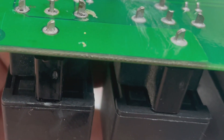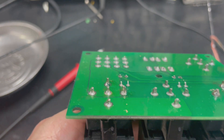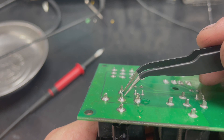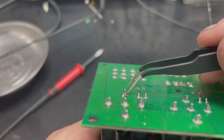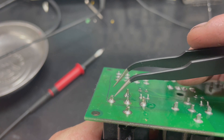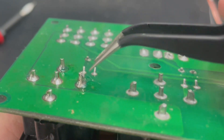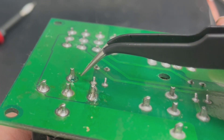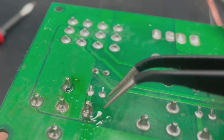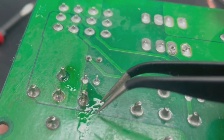Let's go ahead and do the work and show you the result. And here is the result. As you can see on our solder joints here, we have a very nice cone shape. You can see that the center has fully welded and adhered to the pins. You should look for this to be flush with no bumps or bubbles or pitting of any type on these joints. We've also, in the shiny green areas around this joint and up to here — where the solder mask had been scraped up and removed — we've added our overcoat enamel that will protect the board from carbon buildup and creating conductors where there should be no conductors.